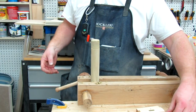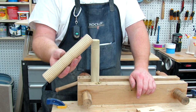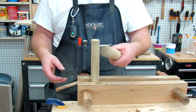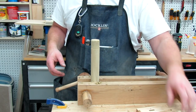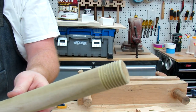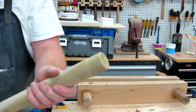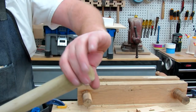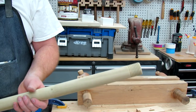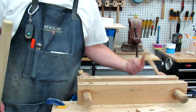What I do is I keep this from the last time when I was making this vise itself — you can just make a nut or a handle, and you can make your screw portion. The green wood makes a really nice clean thread. One of the things I find that makes the thread work a little better is to just sand down the points a little bit with some sandpaper like that, and it seems like it's a lot easier to turn in and out — which is what I did with my Moxon vise, and it is just smooth as silk.